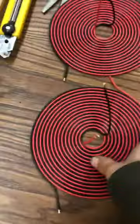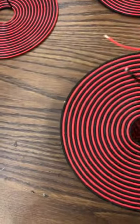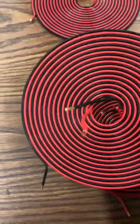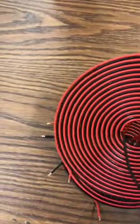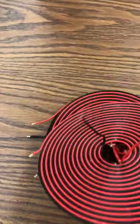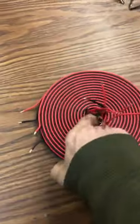First thing that goes on — you put them all on here, one after another. They're all wound in the same exact direction. It's really, really simple. Even the wiring is extremely simple; none of this is difficult. I will release a finished wiring diagram, probably tomorrow or the next day, public for everybody. Half the diagram is up now, but the other configuration of the caps isn't up yet. They go on here like this — all those wires come out the center, and that's it. From there, they get stacked all in sequence and realigned so that the wires correspond properly on the output and on the center, then wired and glued together in the five-stack.